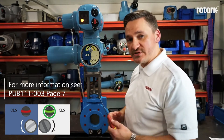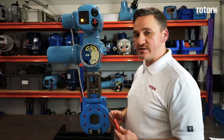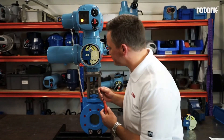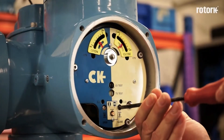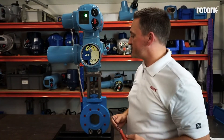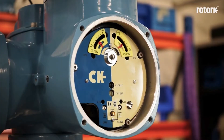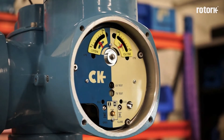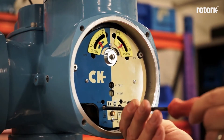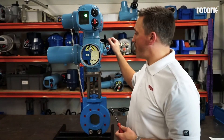If I am rotating in the opposite direction to the arrow shown on the plate, I must go past the limit and then back onto the limit so that the final approach is always done in the direction shown. I rotate the screw clockwise until the closed limit indication has been achieved. I now must return the set/run screw to the run position. It is possible that the gears have not realigned correctly, so a small adjustment of each screw ensures that the gears have correctly realigned. I must now operate the actuator to the open position.